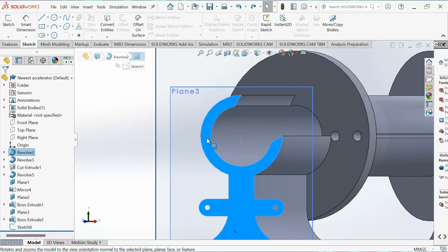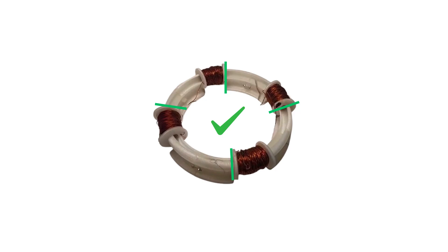This made the total wall angle 250 degrees, which prevented the magnet from leaving the track. Another thing I'd like to mention is that if someone wants to redesign my accelerator, I recommend making the segment from the end of one coil to the end of the next coil, rather than cutting the track in the middle between the coils.